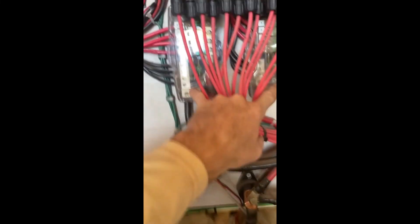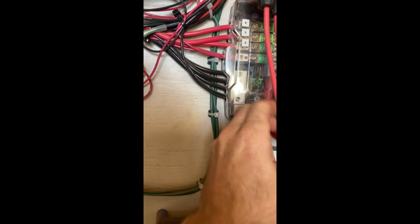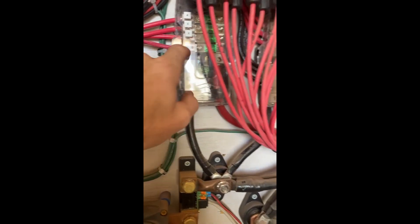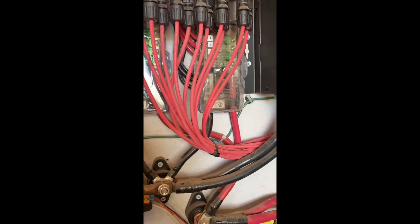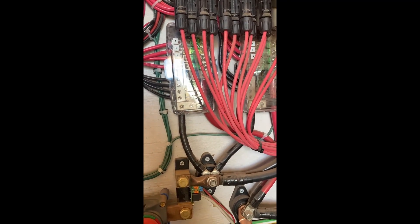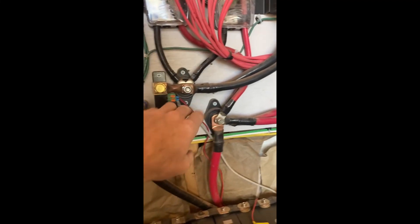The output comes through fuse boxes — they're hard to see under the wires, but every single one has a green fuse. I've left two open slots for expansion later on, because eventually we plan on upgrading to about seven kilowatts. After the fuse boxes it comes through to our combiners and into our batteries.